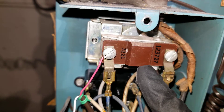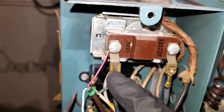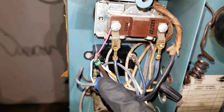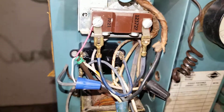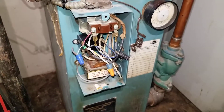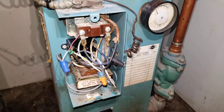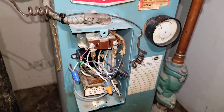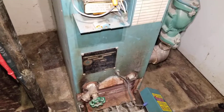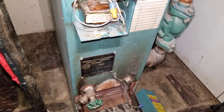The aquastat breaks the switch here, burners cut off, and the pump is still energized because there is still a call for heat. The pump is running — and that is good to go. That's what I wanted to confirm: even though the burners are off, the pump is still on.